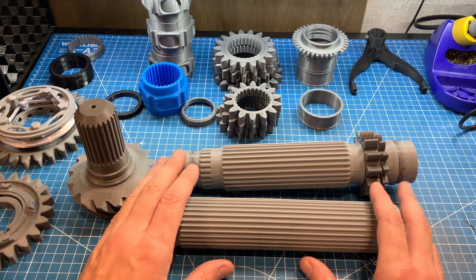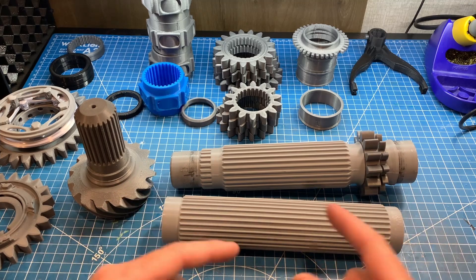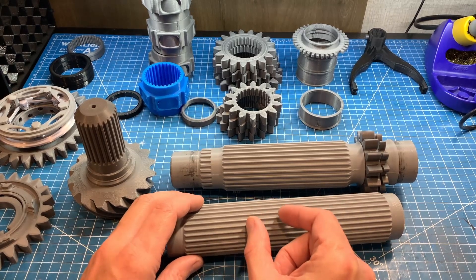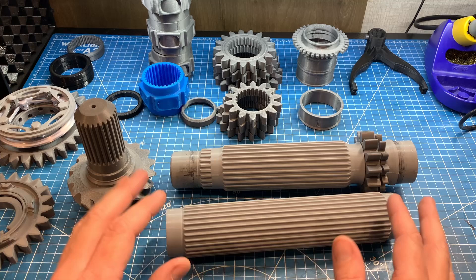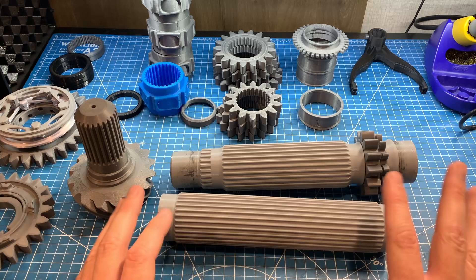Stepping back a bit design-wise, I found it's best to start by perfecting the main shaft and the lay shaft for these gearboxes first, and then jump around a bit once we have these parts baselined. Before I even printed the whole shaft, I printed several test sections to ensure the clearances for the splines, the bearings, and the hubs are all good. Once that's set, I printed the whole shafts. These aren't the final material, but they'll work great for mock-up.